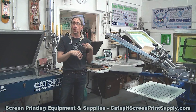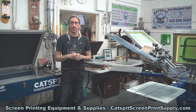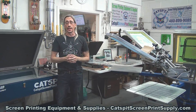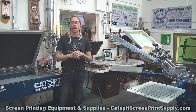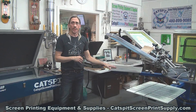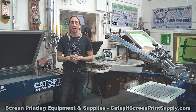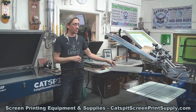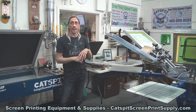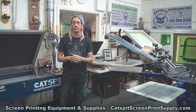You're flashing and the pallet and/or shirt is getting too hot, causing the ink to semi-cure and start to clog the mesh. The solution is to simply allow enough time for the print and the pallet to cool off between printing colors. That's why we have rotary presses where the print heads and pallets rotate — that allows the shirts and pallets time to cool off between colors.